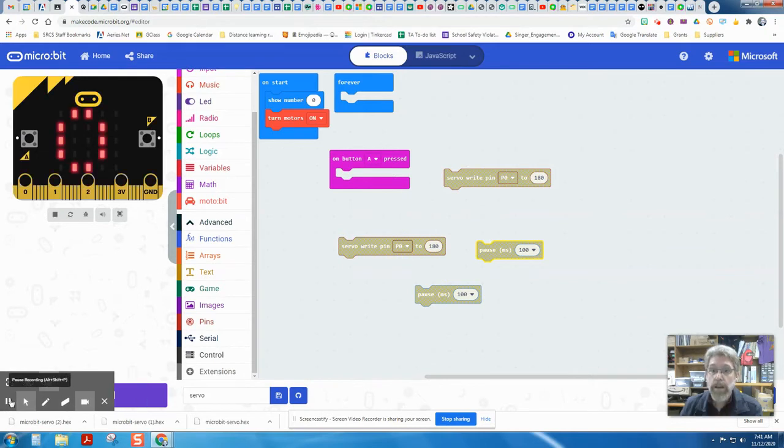Okay. Now, at first, we need to figure out what angles to put the servo at. So think of the protractor example. This has all the angles starting with 0, 90, and 180. Now, the blue part of this servo is going to be attached to your robot somewhere, and the white part of the servo is going to be what we attach whatever is going to move to. And this has the ability to move to any angle we want from 0 to 180 degrees. So depending on how you hold this thing, it can produce different kinds of motion.